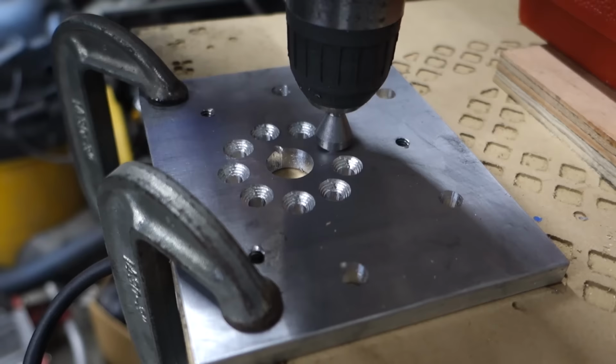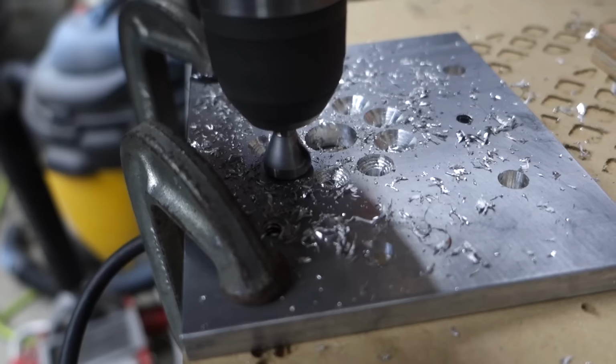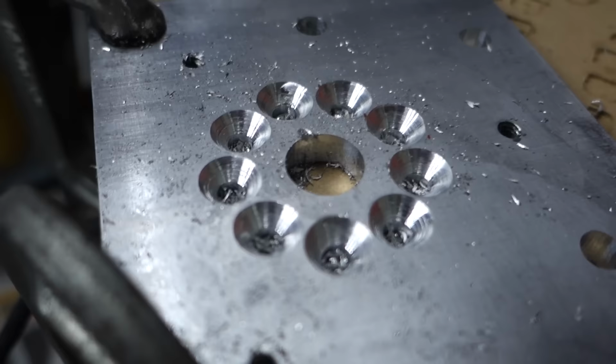So then you used what was the tool, the taper? We used a countersink, but the unique thing we did was we had it machine out a stair step of the countersink so that when I then ran a normal countersink bit in, I only had to go to the place where we got rid of the stair steps, and that way they're all exactly the same height, unlike when you do a normal countersink and you're not really sure exactly when to stop. No, and it absolutely looks gorgeous.